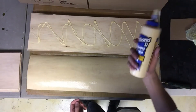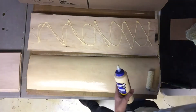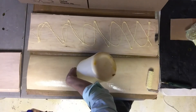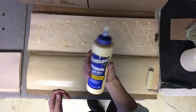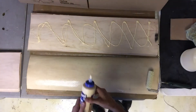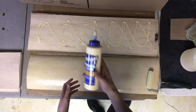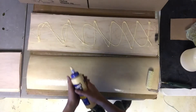Right now I'm using just the 16-ounce bottle, but I usually use the gallon jug. I use two medium-sized globs in the middle and spread it around. For this one I'm just using about two passes back and forth, and I think that should be good enough. Also, you have to make sure to apply glue to both sides of the veneer, not just one of them, or you'll have another delamination problem.